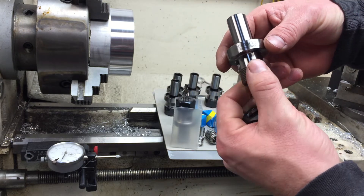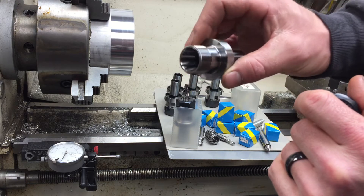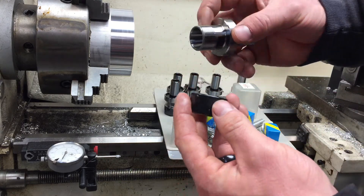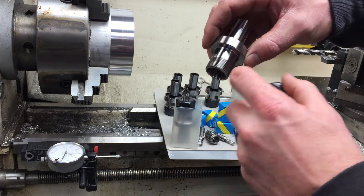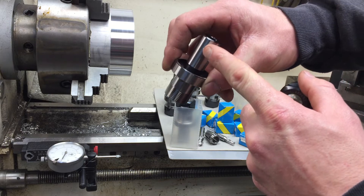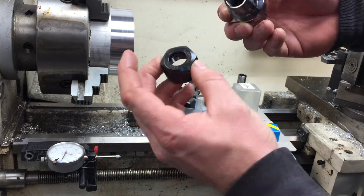For 10 of them, these were about $160. The quality is outstanding — absolutely perfect from everything I can see. They've got the slots on there for your wrench to go on. It's got a three-quarter inch shank for the Tormach-style tool changer setups. Very good quality.